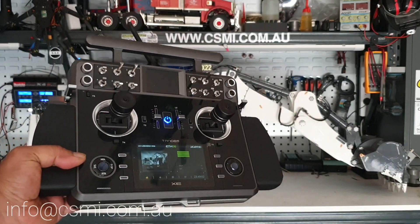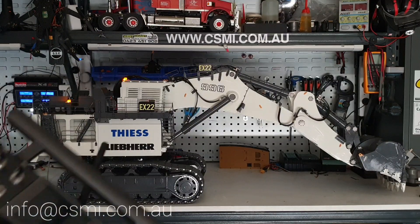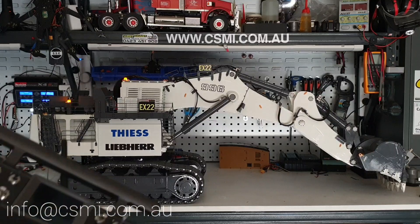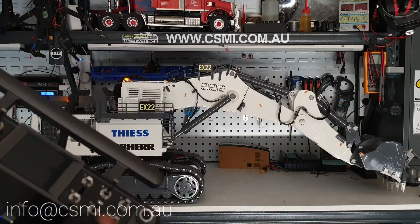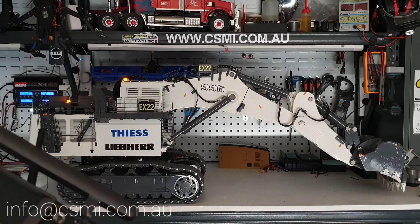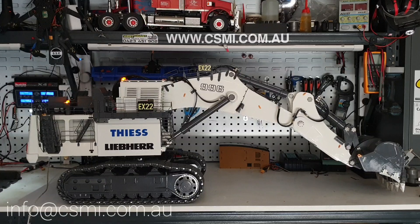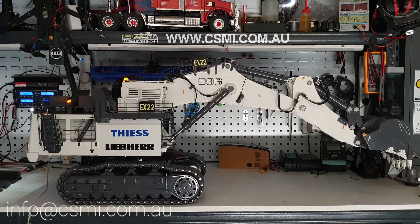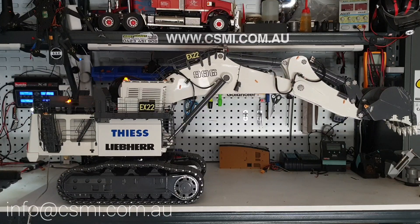This is the remote that comes standard from the factory, and it has some really cool functions. You can jog the machine using the spring-loaded levers on either side, and you can have on-demand hydraulics — pull the lever and the machine immediately runs up — or you can run the pump on a continuous mode if you choose. Right now the pump is set on a very slow RPM, but if you wanted to crank it up on demand you can get pretty fast movement.